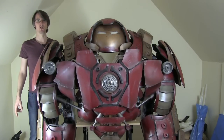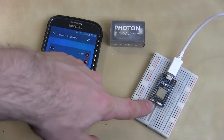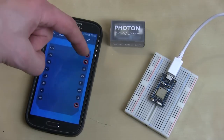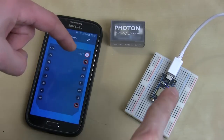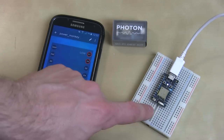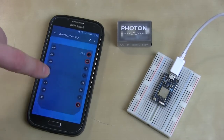I need to now control all of those things from the smartphone, so let's have a look at that Photon again. To do smartphone control I'm using a Photon from Particle.io — have a look at part 36 for an in-depth explanation. Essentially it's this tiny board here which talks to the cloud, and there's a phone app called Tinker which I'm just going to use to get this going, which allows me to go and toggle pins. So if I do this, you should be able to see that additional LED coming on there when I'm turning on pin 7. That works pretty well — I can turn any of the digital outputs on, read digital inputs, and also read and write analog as well. This works out of the box with the default firmware and the phone app. You can write your own apps, your own web pages, get these to talk to each other over the internet, and you can program it like an Arduino — even over the internet. The important thing is that both the phone and the Photon talk to the cloud, not directly to each other, so I can control this from anywhere on the internet.